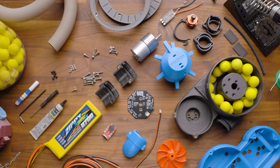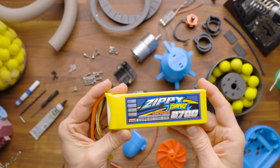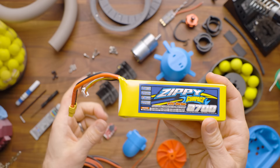Before we get started, I want to talk about LiPo safety really quick. First of all, read the entire article and watch the video that's down in the description on LiPo safety because what I'm saying right now is not comprehensive. LiPo batteries can be dangerous. It's really important that you handle these with care, charge them properly, store them properly, don't leave them in high temperatures, charge them when you get them because they are shipped at storage charge, and always use a LiPo alarm.